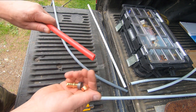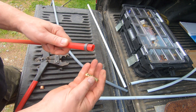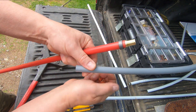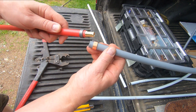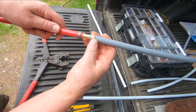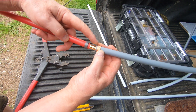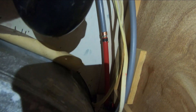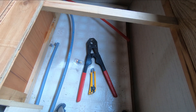I'm going to make that connection. I'll put a crimp ring on the PEX line, put the PEX fitting in, and crimp that. On the poly B side it's the same thing — I'll put this wide band on the poly B, insert the fitting, leave it sitting back about an eighth of an inch from the edge of the hose once it's inserted, then crimp those down. There's the join — that's the poly B on the top coming down to the PEX through a 90-degree fitting.